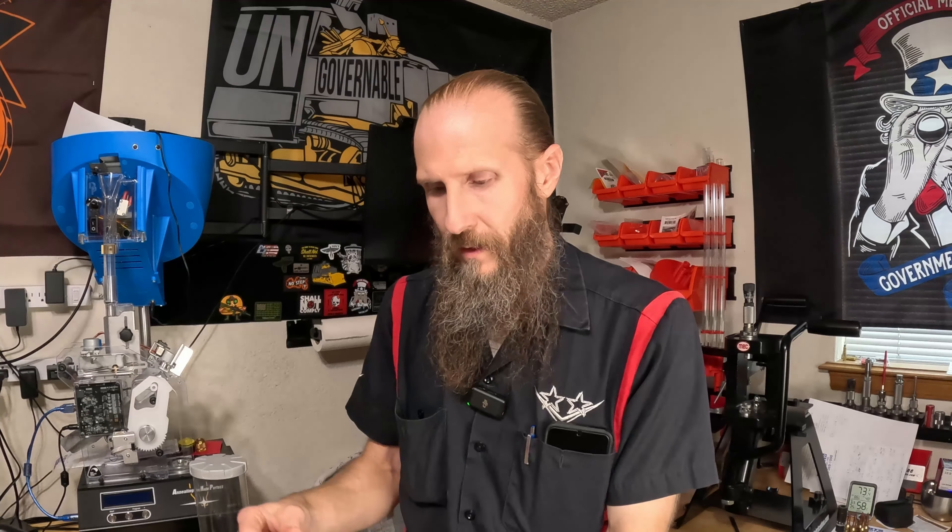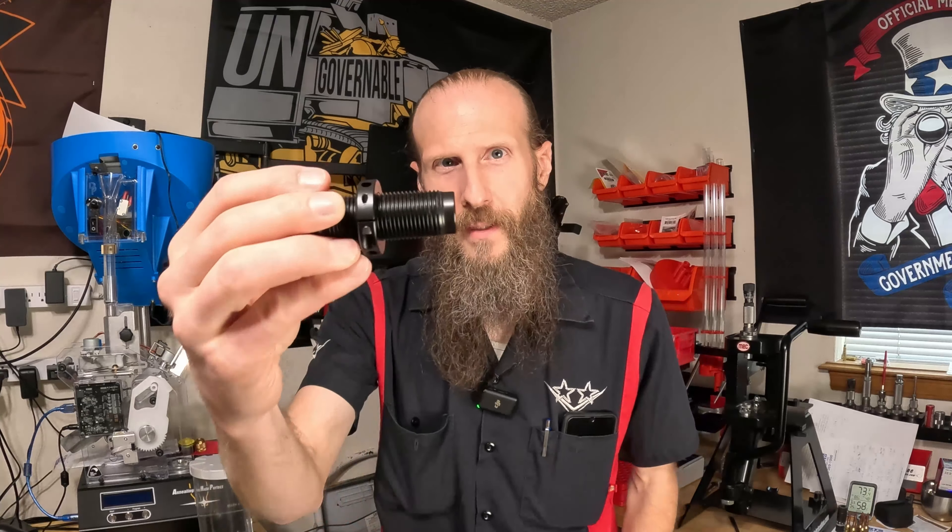We need to take a look at this — it's from Cortina Precision. I picked up their mandrel die. Several people mentioned I should be adding one of these into my steps if I want to get maximum consistency every time I resize and prep my brass. I got the 241 mandrel, which should be what I need for my particular bullet and brass combination. This will probably be what I learn about next weekend because I've never set one of these up, so stay tuned — I'm sure I'll mess it up the first few times.